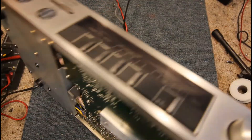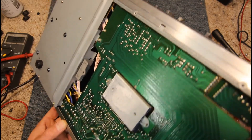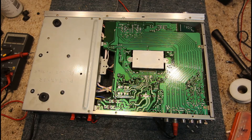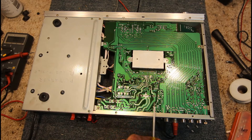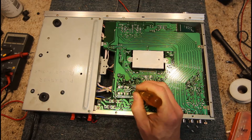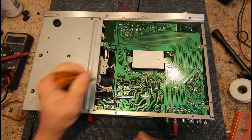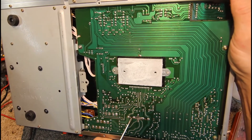We'll just go over and check for dry joints in this thing. Volume control looks good. Always worth checking these switches along the front because they get a bit of vibration from people pushing on them. Definitely this area around here where it's a bit darker. So basically looking for any joints, especially in the hot areas, any joints where the solder's not shiny anymore — it's a bit crystalline. You can sort of see a little bit of texture in the surface. Also you start looking for a bit of a ring around the actual lead — you can see it's starting to crack about halfway between the middle and the outer of the solder blob. You'll start seeing a dark ring going around the leads. These amp chips, always worth a check — I can just see them starting to crack so I'll re-solder those.